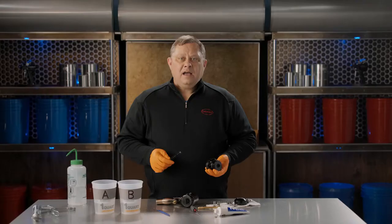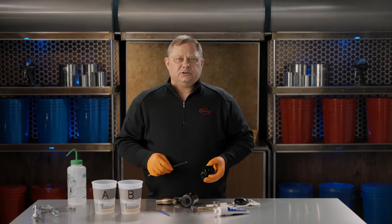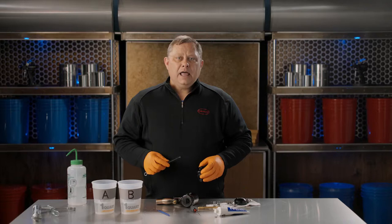After we clean the head of our gun, we want to clean the filter cartridge parts very well, including the cartridge itself with MEK or acetone. After we do that, we'll do the same to clean the side seal cartridge parts, and then we'll be ready for reassembling.